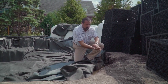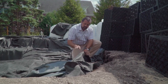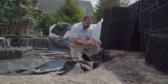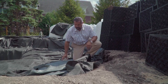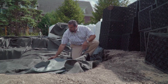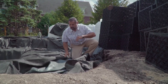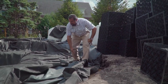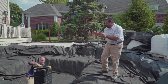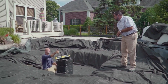We're going to use washed concrete sand to protect our liner. We're also going to use a minimum three-and-a-half-ounce non-woven geotextile over top of that sand layer, approximately one inch thick. We're going to use an EPDM liner — that's what's going to hold the water — and then protect it again with a three-and-a-half-ounce minimum non-woven geotextile fabric. We're going to install our pump vault into the center of that area at its lowest point, making sure it is level and plumb. Excellent.